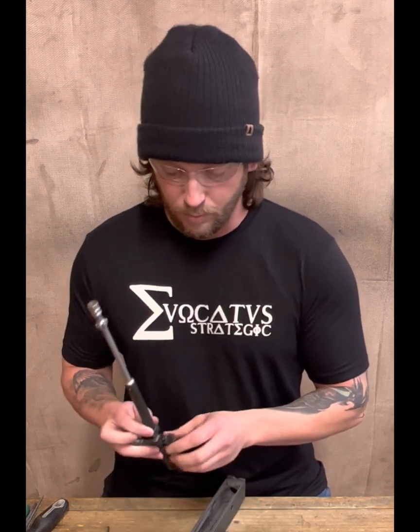I had a question from somebody, and there were concerns about removing material from the back of the lugs that would potentially harm the case hardening or the heat treat of the bolt. Well, I can tell you, if you've built enough AKs, that's how you force match them. It's the same process as force matching a bolt action rifle. You are removing material from the back of the lugs so that when it goes into lockup in the cycle of operations, you're achieving the proper headspace.